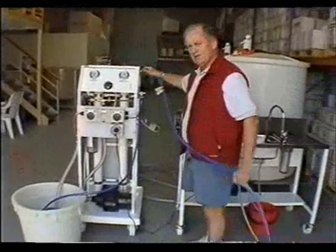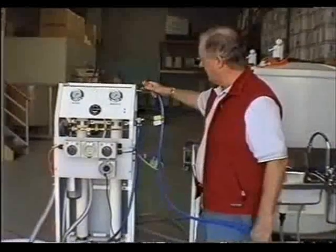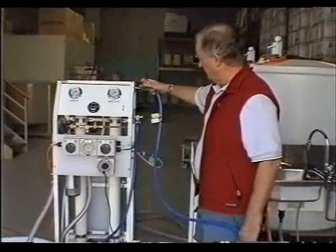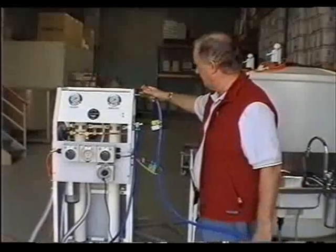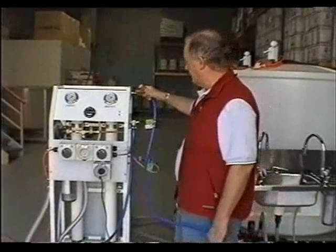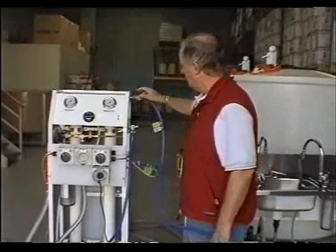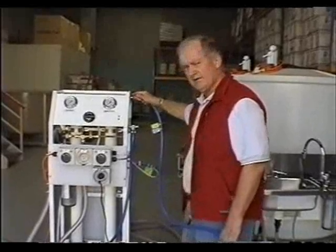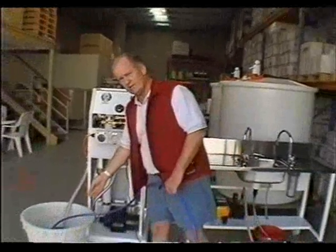During citric acid cleaning, there is some bleed from the system. It's only a small bleed, but the water is annoying, and for this reason we put a further drain hose on the normal product water outlet, and that also runs into the 75 litre container.